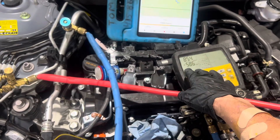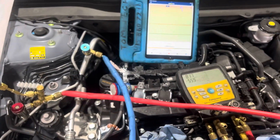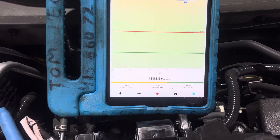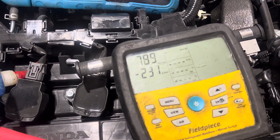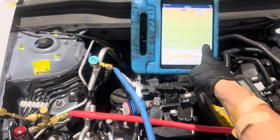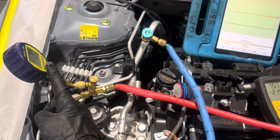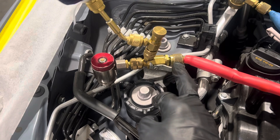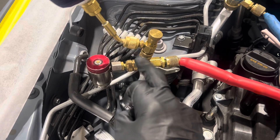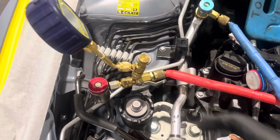This is why you don't trust this if you have one of these. Now as you see, it's still pulling down. We're at 1800, but we say 790 right here. Now for me to get a real reading, I have to kill the vacuum and isolate the ball valves. And as you can see, when I turn this off, it will isolate and keep this in the system, but it will separate it right here through the ball valve to the actual vacuum.